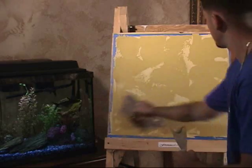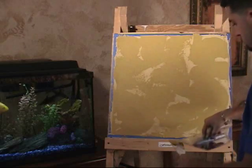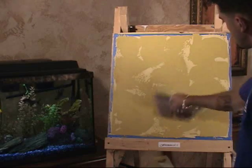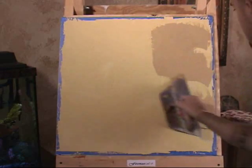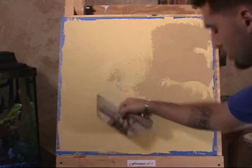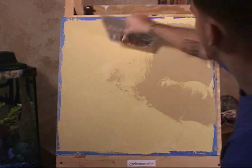He lays a little glob on the wall and then strategically moves the plaster in different directions to create his look. After that coat is dried, he comes back with fine Marmorino and applies it on the high spots, smoothing it off nicely but leaving some areas untouched.